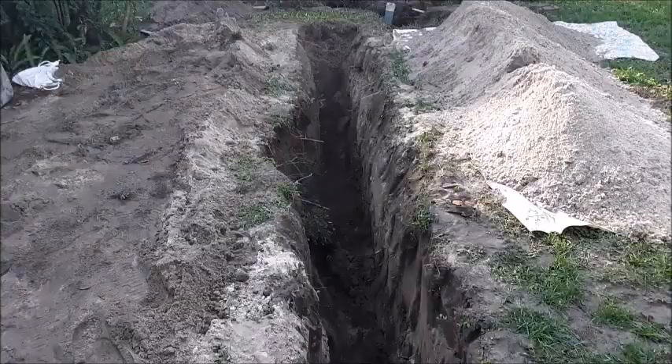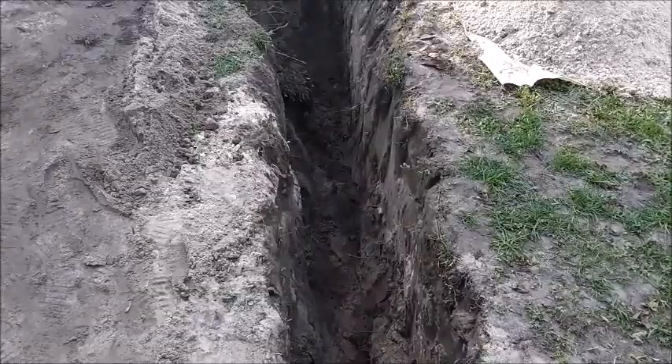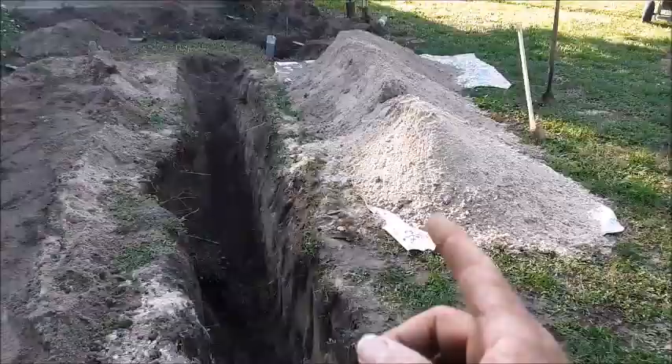Dig a trench right away from the location of your septic tank. I like to dig these trenches extremely deep. The trench is going to start about two to two and a half feet wide and taper down on the sides until we get down to a shovel width. Our sand is very percolating, so it's probably a good idea to wait until you have your gravel ready before getting down to that last foot or so, because you don't want a cave-in. You'll have a lot of displaced dirt, so if you don't have a place for it, you'll need a trailer to haul it off.